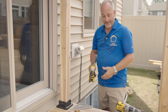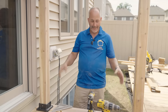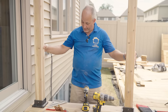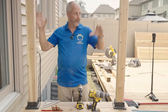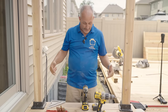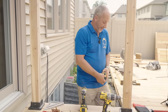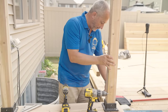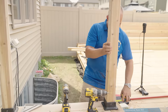Okay, I'm only gonna put one screw in one corner right now. All right, I'm gonna set this one up, same thing, one of the outside corners. Allows these to all rotate in place. Then I'm gonna build all of this, and then I'm gonna set the rest of the screws, okay? Just a little bit of voodoo goes a long way here, guys. Setting up 1 3/4 again off the edge, 2 inches off the front, pre-drill.